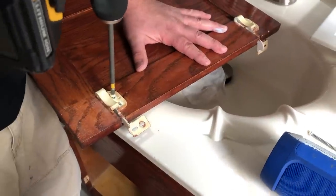The first thing you want to do is remove all the cabinet doors and hardware from your wall units. Make sure that as soon as you remove your cabinets, you label them. The easiest way — which my husband figured out — is to number them from one end of the kitchen all the way around. The top ones are T1, T2, T3, and then starting at the same place on the bottom, B1, B2, B3, so you can keep track of what door goes on which cabinet. It makes installation a lot easier, and what we use is basically just some regular frog tape.